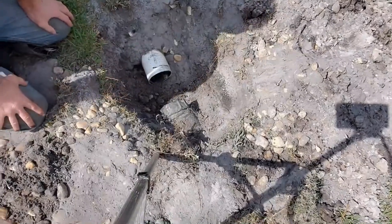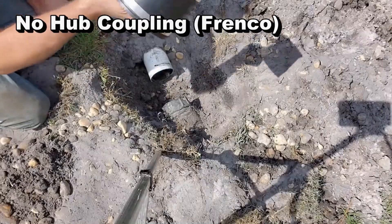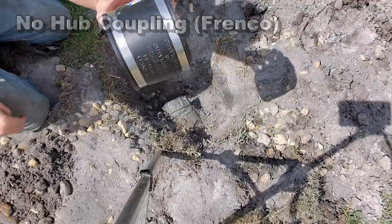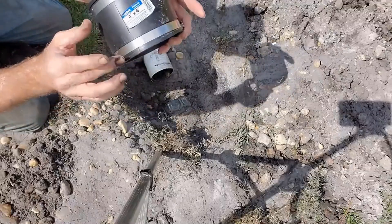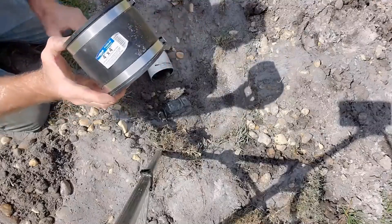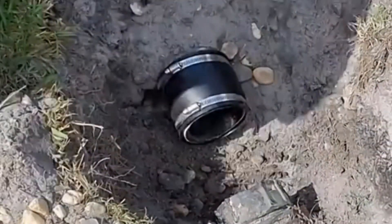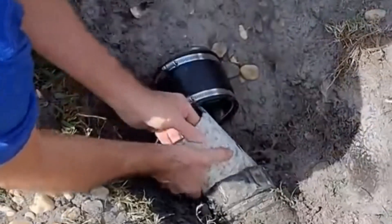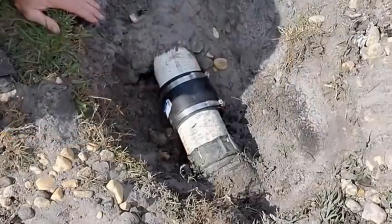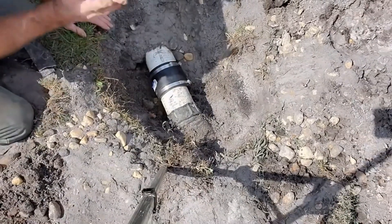A couple of ways we can make this repair. The easiest way is to use this four-inch no-hub. It's just like you've seen me put on the sump pump with inch-and-a-half pipe, but this is four-by-four — cast iron to cast iron, or cast iron to PVC. It's a little larger than thin wall. You slide it onto your pipe, giving it plenty of room. We can use the piece we cut out to get it started, then slide it back on, tighten up those two little bands, and it's ready to go.